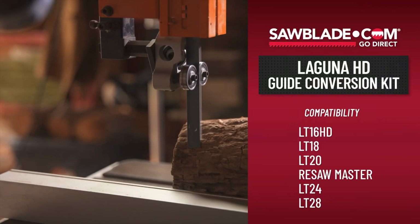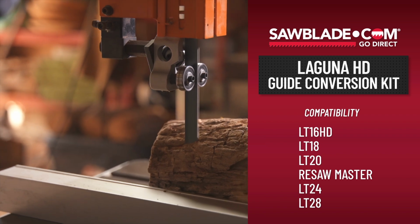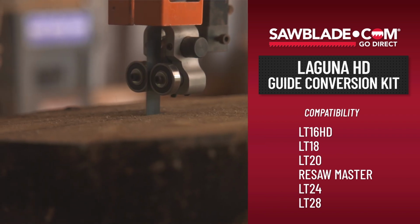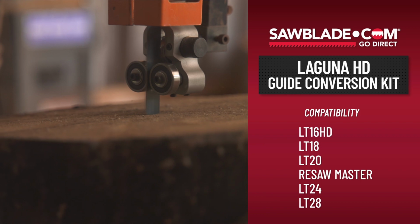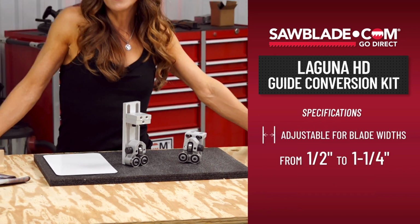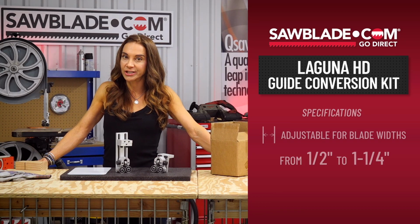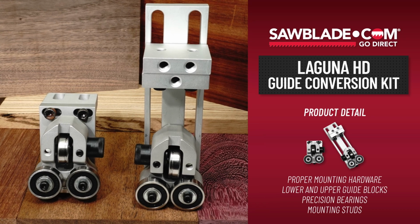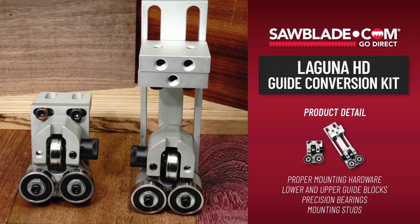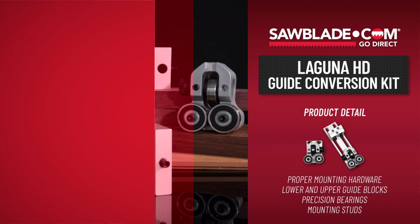This specific Laguna upgrade kit is designed for Laguna models LT16HD, LT18, LT20, Resaw Master, LT24, and LT28. This heavy-duty kit is adjustable for blades 1/2 inch to 1 1/4 inch and comes complete with the proper mounting hardware, lower and upper machined guide blocks, precision trio bearings, and mounting studs.